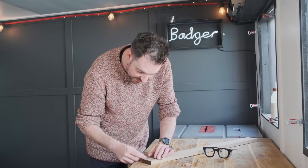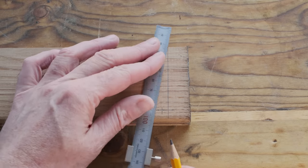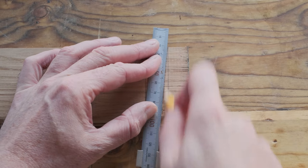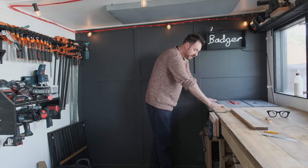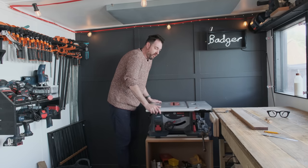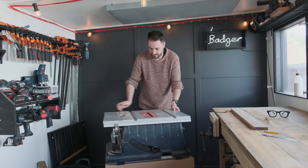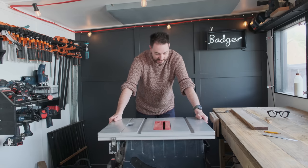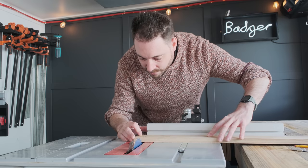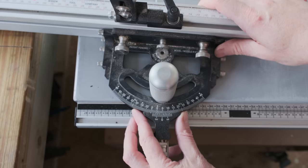I think these should be pretty easy to make, really just three bits of wood. In the middle, a wedge, and then two prongs. I haven't measured the angle of that wedge precisely, but really, what it needs to be is just wider than the slot of the toaster, I feel. So now I can get the mitre gauge out and get this cut. Just eyeballing it with the mitre gauge, it looks like I'm gonna go for a 5 degree angle.